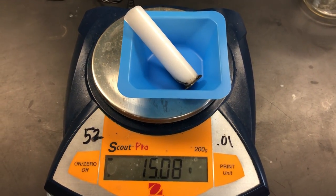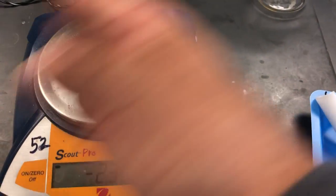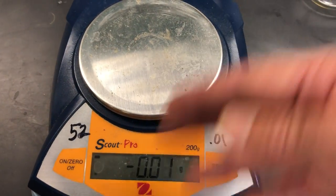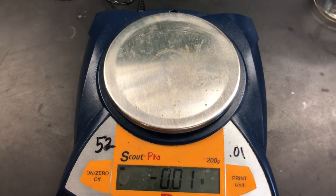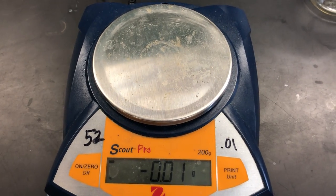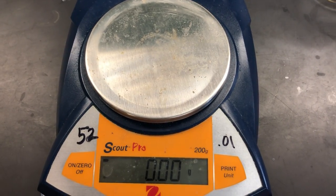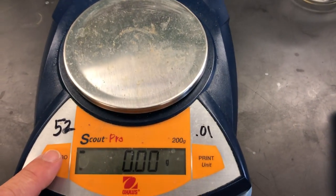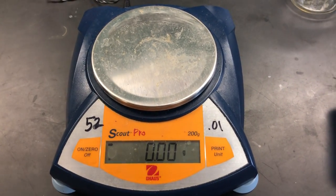To find out how much of the candle you burned, you simply subtract: 19.00 minus 15.08. A couple of rules about the balance: please be gentle — all I have to do is wave my hand near the balance and the numbers move, so just the pressure of the air hitting it is enough to make it move. If you put something heavy like a book on it you could ruin the springs inside. Also, never put something really hot on an electronic balance — if you're burning things, let them cool for a couple of minutes first. Remember: the on button also works as the zero or tare button, be very gentle with it, and don't put hot materials on it.